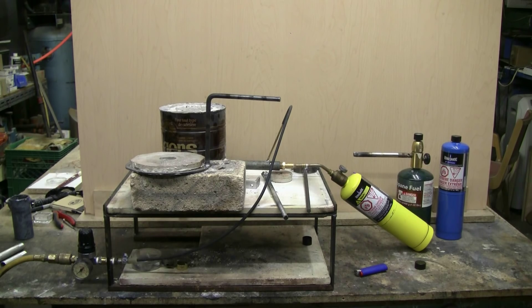The fourth video will be about furnace burners — whether you use a propane torch for simple aluminum melting or use the air-assisted powerful burner made from plumbing pieces shown in this introductory video, which is easily able to melt aluminum in a few minutes. The fifth video will cover testing and curing of the newly made foundry furnace. The sixth video will be about crucibles — I'm showing welded steel crucibles here, and there are several alternatives for do-it-yourselfers that I'll go over.